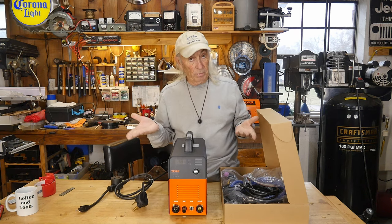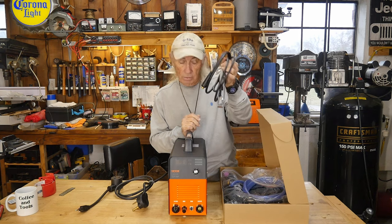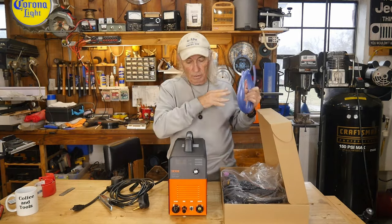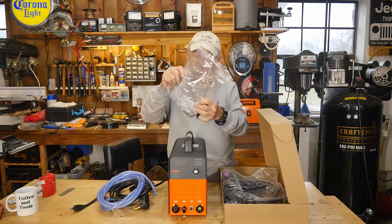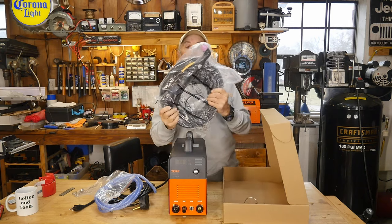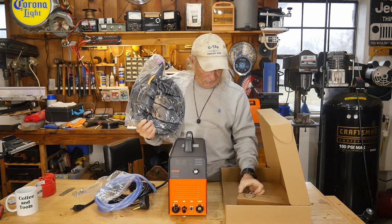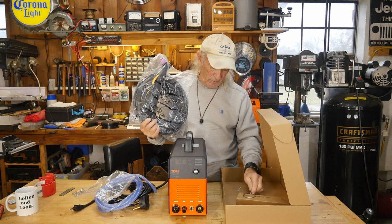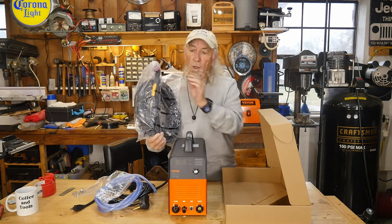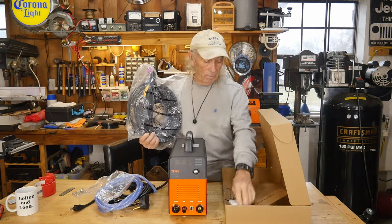This can put out up to 50 amps, so you don't want to push that too high. It includes a nice grounding cable, and also the airline you'll need for running a little bit of compressed air to blast the plasma through during cutting. They also include clips for plumbing work, tubing, a big long heavy cable for the arc and plasma cutter itself, and a couple of little wire offset stands that you put on the end to help keep the head off the metal and clean.